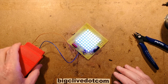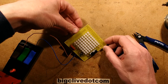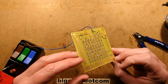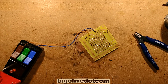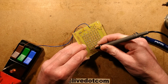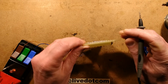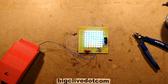Okay, that LED may be in the wrong way round. I've got the advantage, I've got a discharge resistor here now, that's quite good. No, that LED looks like it's in the right way round. Is there a solder bridge across that LED? Let's use a pointy thing to just double check there isn't. Oh, there may actually be a wee solder bridge across that, which I may or may not have removed. Okay, let's give that another go. No. Okay, I shall check that out afterwards.